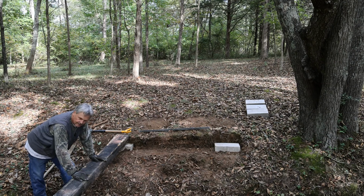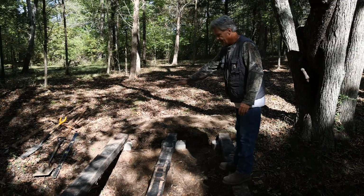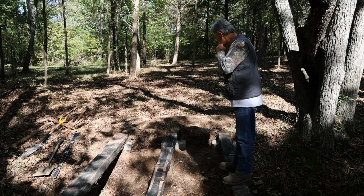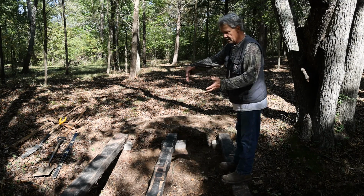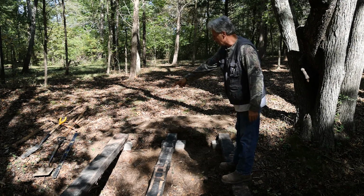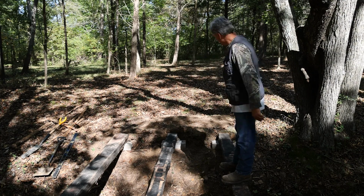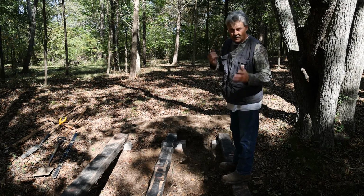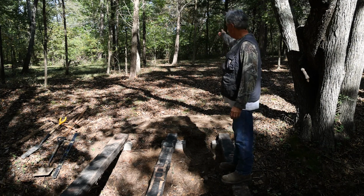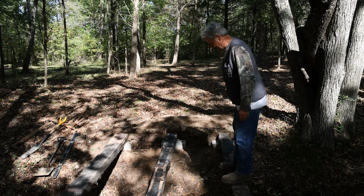By the time we get our planks up here on top, it's going to be a pretty smooth bridge this time around. I do have a slight slope heading down the hill. I don't want water setting on top of it. And due to the fact that we're dealing with irregular sized lumber, I squared everything up pretty much to the center of the logs themselves. Because if you go corner to corner, it's narrower on this side and larger on this side as far as diameter. So squaring up is a challenge. And I definitely step back and look at it and see how it looks as well. We are definitely solid.